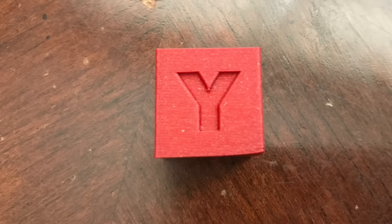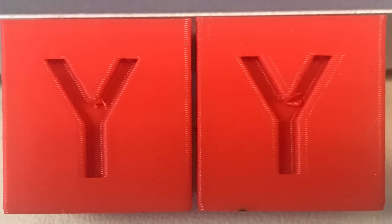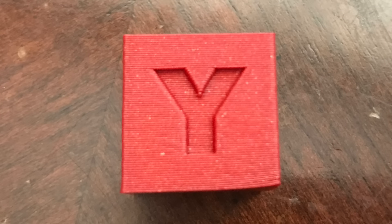One area I was really impressed: on the CHEP cube there's no ghosting, no vibrations showing up on the Y-axis. When you have a glass bed moving back and forth you tend to get ghosting or ringing from the weight. The Ender 3 without glass shows clean results, but the Ender 3 with glass shows ringing. But look at the Sovol SV01 — it has a glass bed moving back and forth and there's no ringing, no ghosting. This is impressive. They got their acceleration and jerk settings just right.